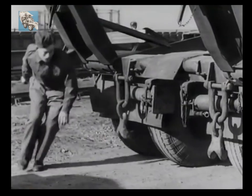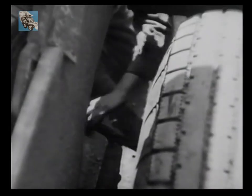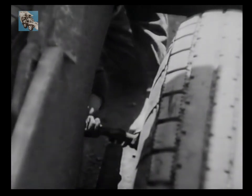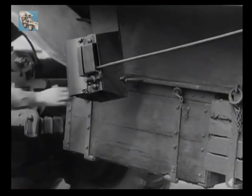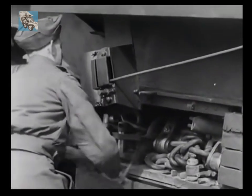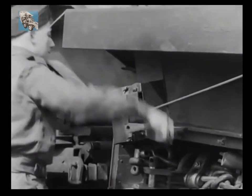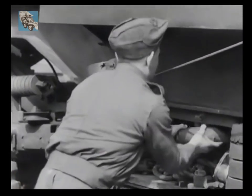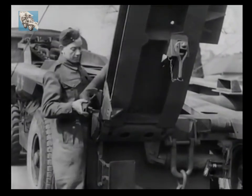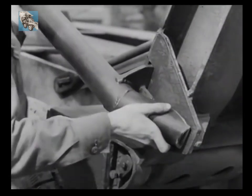Now this has been done, you may apply the brakes on each of your rear bogeys by turning these screws anti-clockwise — there are four of these screws, two on each bogey. The ramp winch handles are carried in the equipment box beneath the platform. These are placed on the ramp winches and tension is applied to the ramp winch cables. The cable guides are then taken and placed into position, forming a stanchion for the ramp winch cables, giving sufficient leverage so that one man can easily raise or lower a ramp.